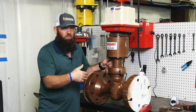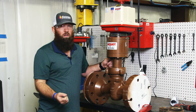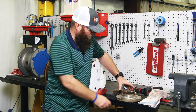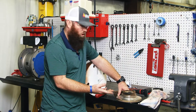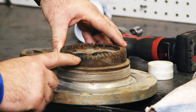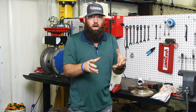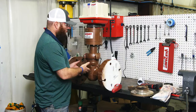It's a very proven valve for wellheads, where there are a lot of solids, so you know how difficult that application is. We've modified it slightly to work exceptionally well as back pressure on pumps. Traditional disc chokes use ceramic or tungsten carbide discs with orifices — and you can see some of those tungsten carbide discs here. With that type of choke you have gearing inside, and if you have any H2S or corrosive elements in your water, the gearing can round off and break. Your actuator tells the valve to go to position, but the teeth are broken and you can't control the valve — you need to break it open and repair it. This valve doesn't have any of those issues.